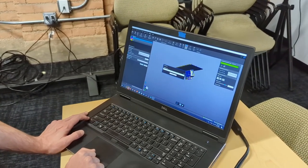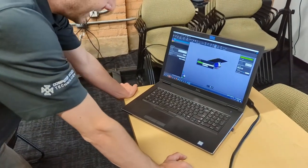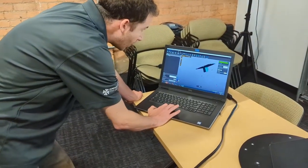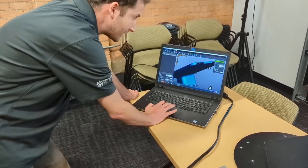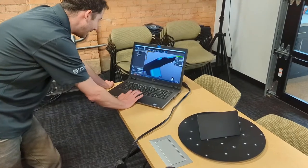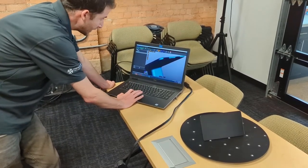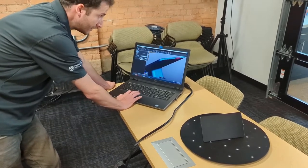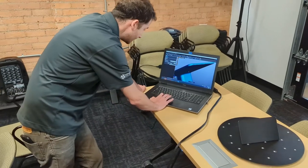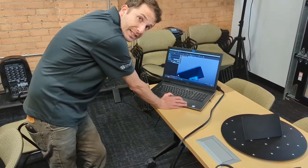The different colors are just showing the different scans — there's no color map or anything like that, just the three different scans being added together. I can still see a couple of holes in this area that I missed during the scan, but that's nothing that's going to interfere with the reverse engineering. Within the software I have the ability to do cleanup in a module called VX Model, which gives me tools like hole filling — it'll identify holes in the mesh automatically. Once we have filled those in and have a watertight mesh, if all you need to do is 3D print this, we can export as an STL and toss that right into GrabCAD Print on any of our printers.